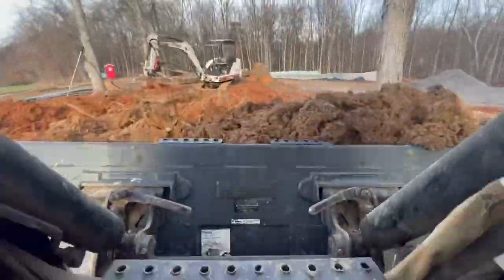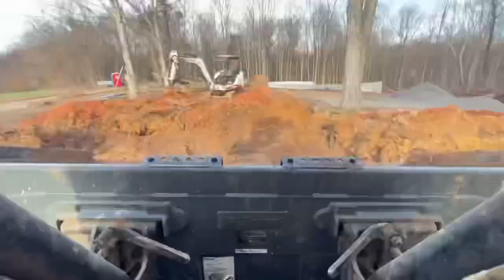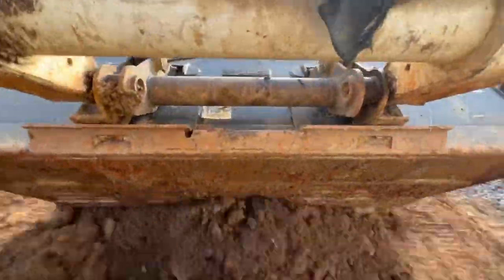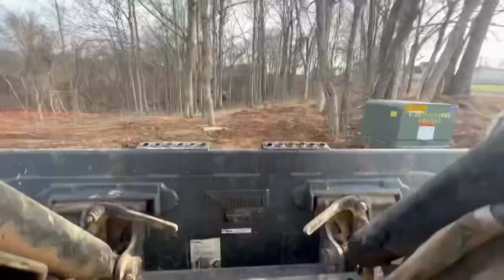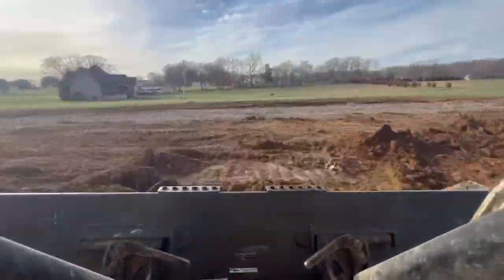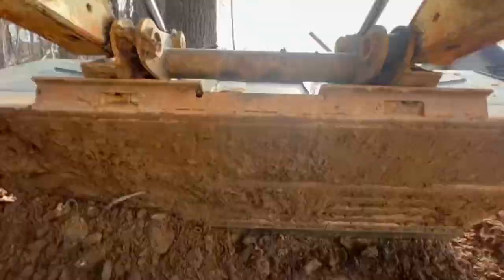One thing I did not mention was when we buried that water line and all these loops here, you'll see in a minute, I really don't like having any crimps, cuts, or connectors underground, not any more than we have to anyway. So the only ones on this site is the two in the meter box and the one for the hydrant. And so once we take the hydrant out, we'll uncurl the pipe, run it under the house, and unless they add something, there will be no cuts, crimps, or connections underground that could potentially leak.